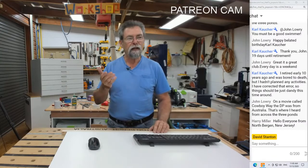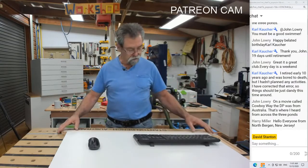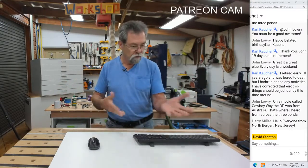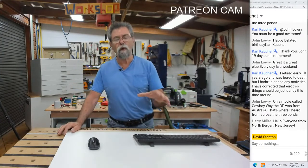And today I've got a fair bit in the show and I'm going to be doing some things that may not be conventional, but I've just found that they work for me. Now, also I'm trying to tame things down a little bit. So if you don't have all the slick gear, if you've got hand tools, well, I'm going to show you how to be able to put this solid timber onto the edge of a piece of, well, in this case, it's going to be melamine, but it could be a laminex top on a kitchen bench or some plywood. I'm going to show you a way that it's going to be easier. Now, I will be using the domino, but you could use dowels or you could use a biscuit jointer.